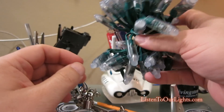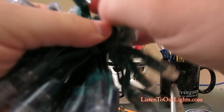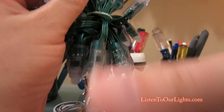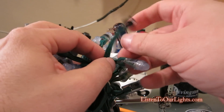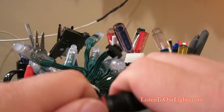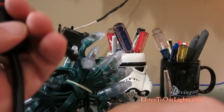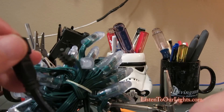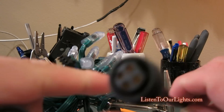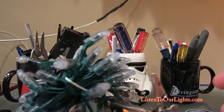In this next piece we're going to lob off the male end of these WS2811 lights and attach one of these pigtail connectors. We've already tested the lights and the pigtails so we know they're working. I use the female end to go on to the controller, which means I'm going to want to put a male end on to the end of this.